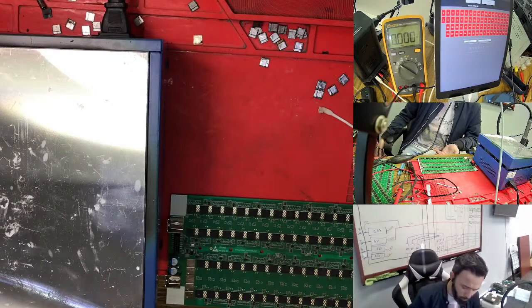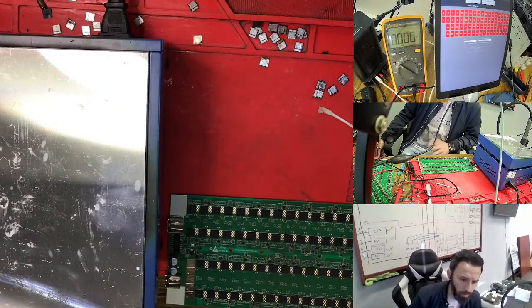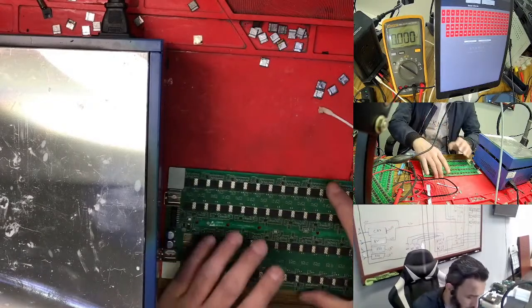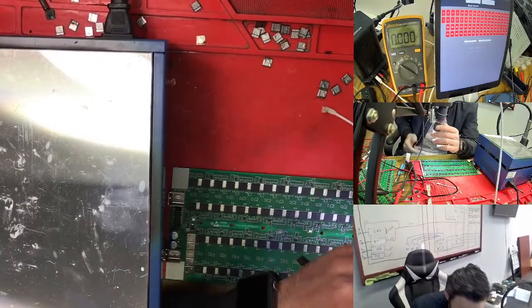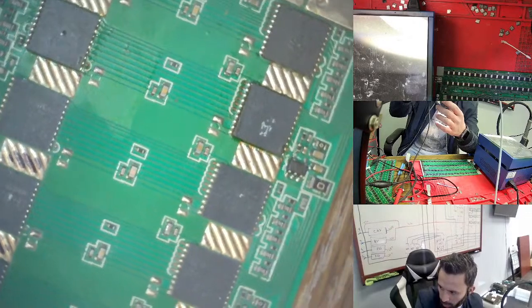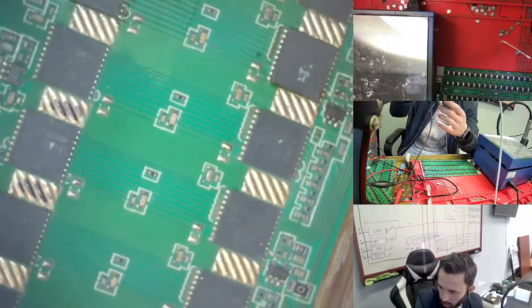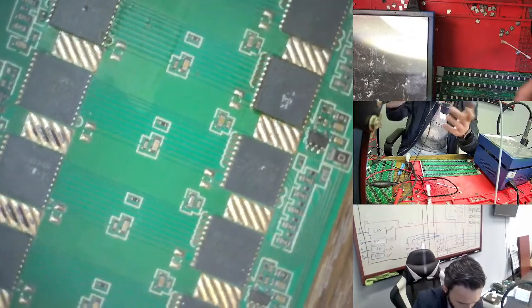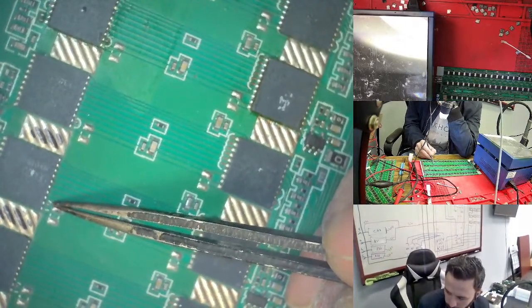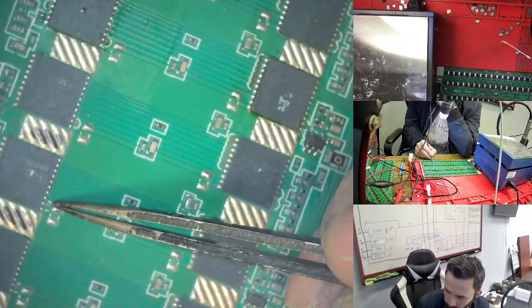But with almost all the new hashboards I find the middle pin, so you have the RX, but for this one it is totally different, because if you look here, you don't have any test point for someone, but actually we don't know exactly. For example, if I go a little bit more up, check here, I'll show you something, because this is very strange. That's why we never figured out what is going on. If you see here what I find, this one actually gave you a 1.5, so anytime the 1.5 here is off, suppose it is not passing anything, so it is still zero.